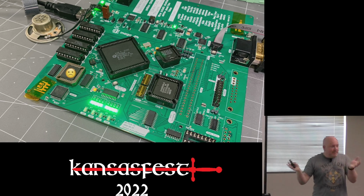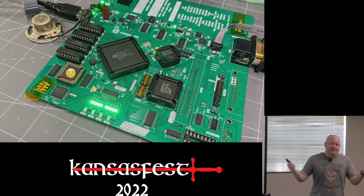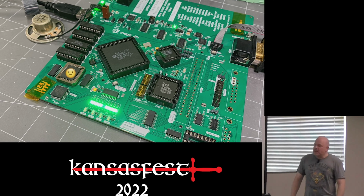Turns out somebody, who will remain nameless, wired the EEPROM to always be disabled. Don't know why he did that, but I tried to bodge it, and then my EEPROM programmer stopped programming the EEPROMs for some reason, and I haven't figured out what's going on with that. Out of 50 attempts, it programmed the EEPROM twice, and I have 15, and I kept cycling through them, and it just fails, and I have no idea why, and one time it'll work. It reads them fine, but it won't write them.